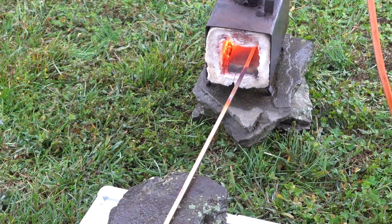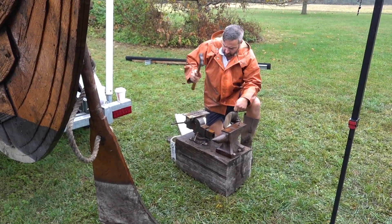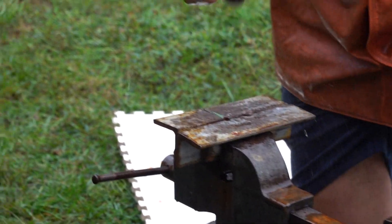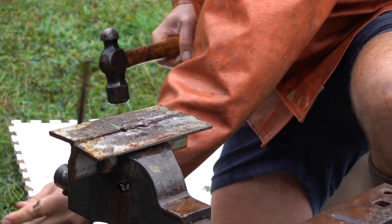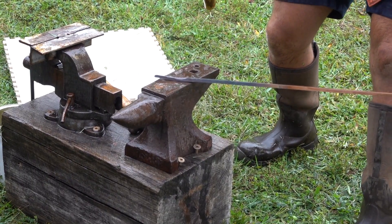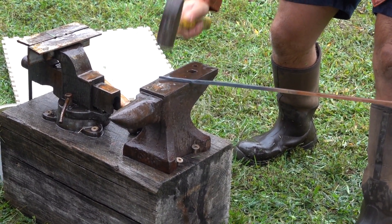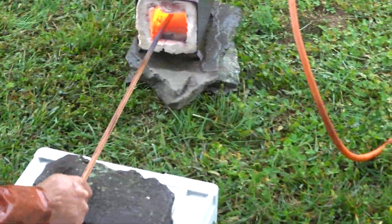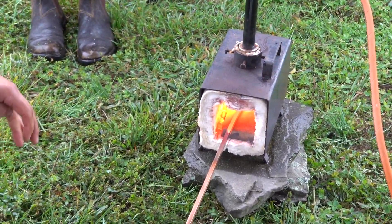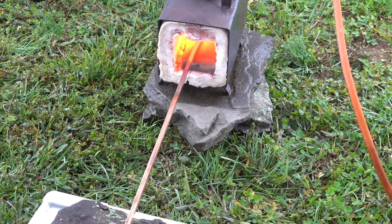Then I'm going to put the head on it. This is called a header — I'm going to bring it back to the head. We have to keep the rivet so you're not pushing wood more than 5/16 — that's right at the surface of the wood. Sometimes we end up tapering it down a little more in different situations, like if it's close to the edge. So we'll have a range of sizes for different situations — if you have real thin planks, or a bad bore where it comes out too close to the lap, you'd want to go for a smaller rivet. It's nice to have a little variability with the hand forging.